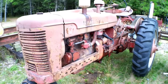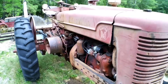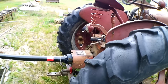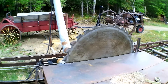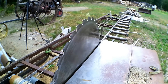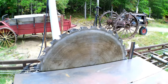Currently our power source is a 1952 Farmall Super M — it's got the high compression pistons and had some work done before I even got it, so it's actually pushing around 60 horsepower, which is plenty for what we're doing with mostly pine. I just slow down my feed rate as needed for oak or whatever. The blade is a 52-inch, 32-tooth blade I bought from Menominee Saw and Supply on Peach's recommendation. He said 32 teeth would take less horsepower and be a better blade in the long run, and it's been a very good blade.